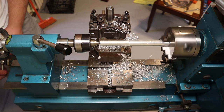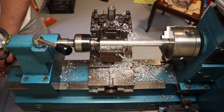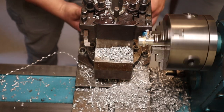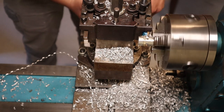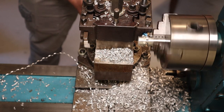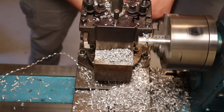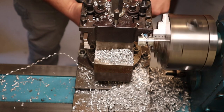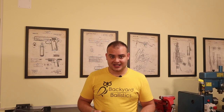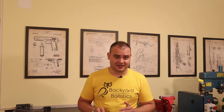For larger numbers I'm having them done on a CNC machine, but I'll show you how I made the prototype ones — those actually tested in the other videos. I started with an aluminum bar and turned it to size. I'm not a machinist, I just had to adapt. After that I started parting 12mm long slugs, but the process was quite tedious, so I stuck the rod in the bandsaw and used that instead. With the slugs cut to length, it was time to drill the nozzle ports.